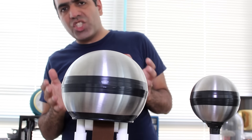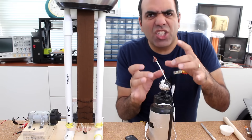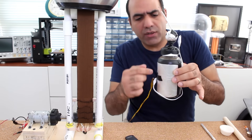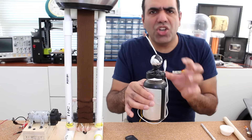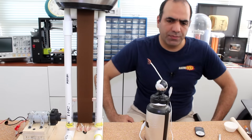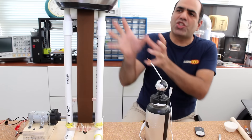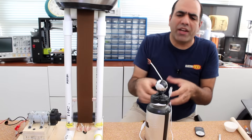The top dome keeps its charge until a pointy object gets too close. I taped a wire to the center contact of my Leyden jar with the end strands poking out, connected the outer contact to ground, and brought another wire from the outer contact close to the center contact with a centimeter gap — so if the voltage on the jar is too much, there will be an arc between them. It seems like it's wirelessly being charged, although it's not truly wireless — the wire here is air, because the charges from the dome are directly flying through the air to the spiky wires and charging the capacitor.